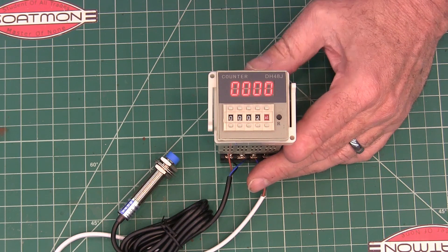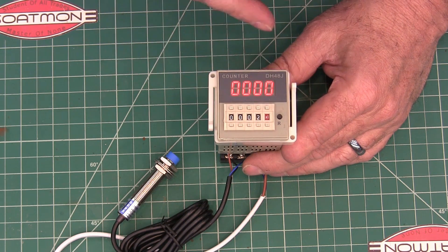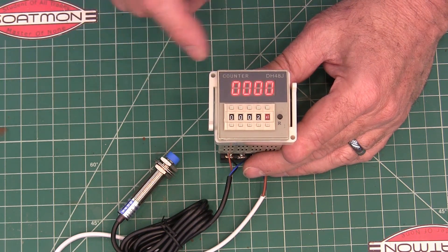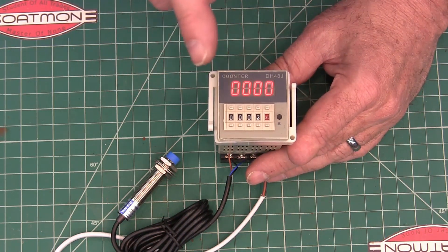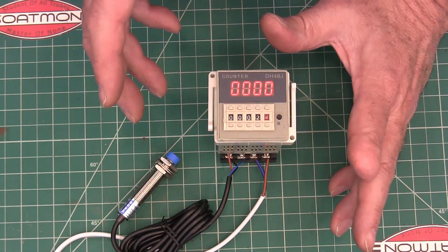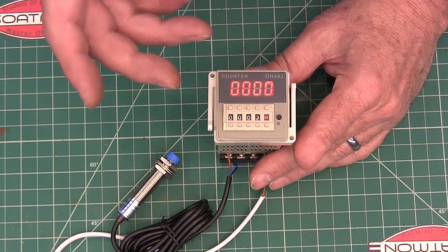It's really interesting. It's got a relay in it that has one normally open and one normally closed contact. And it counts either down or up — so you can count up to 10 or count from 10 down to zero. When it gets to whatever count you want, it changes the state of that relay from open to closed.